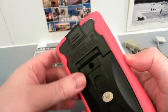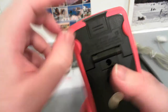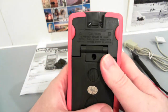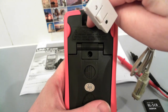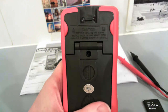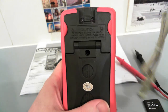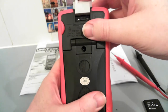Now this is interesting. At the back you've got a little recess cover here, which when you slide it off, excuse me, bashing the camera with my arm, you've got an infrared transmitter here. This is an infrared LED firing out data. This one here isn't actually populated on the board. This is an infrared receiver in my hand. The right hand dot, this one here, the black dot, is an infrared transistor. Slide that on there, slide that into there.